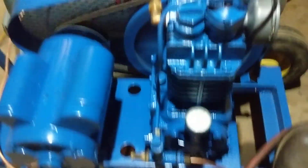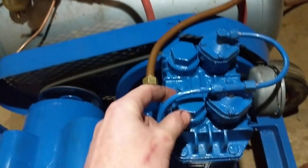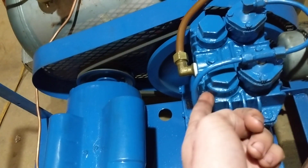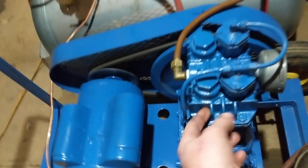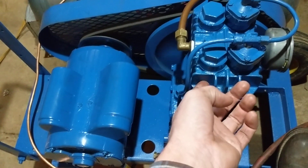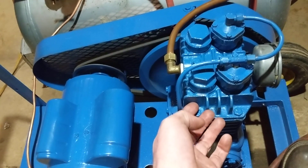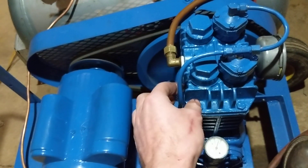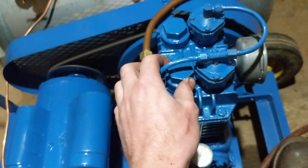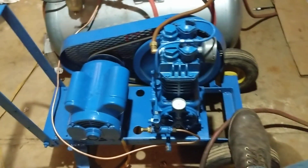I really shouldn't have touched the thing - I had about a day's worth of stress trying to get these output valves sorted. There's a little copper crush ring gasket at the valve seat - not the actual valve seat itself, but the seat for the valve assembly uses a copper crush ring. I had a hell of a time getting the new ones properly seated. If you've never taken apart a Quincy before, the valve hold-downs require a special tool. I had to cobble something out of an old chrome socket to make one, because using a wrench on its side wouldn't have given me the torque needed to get them all the way down.